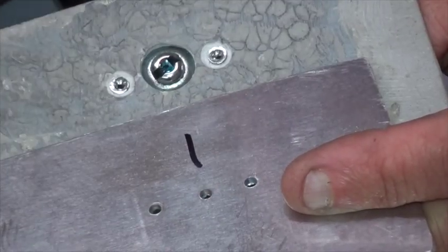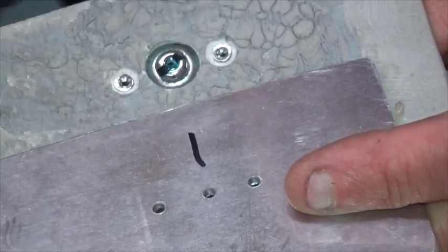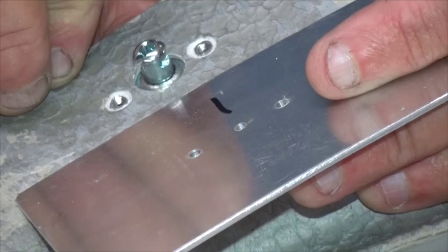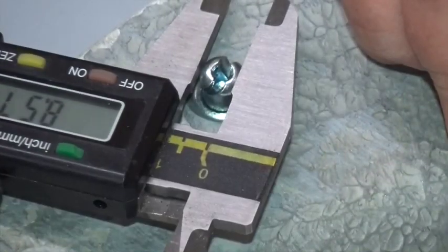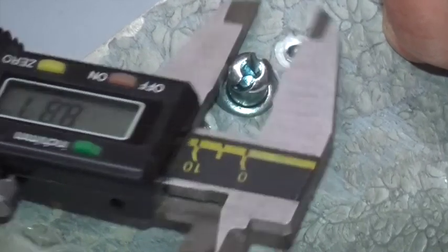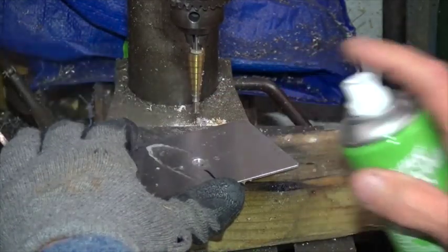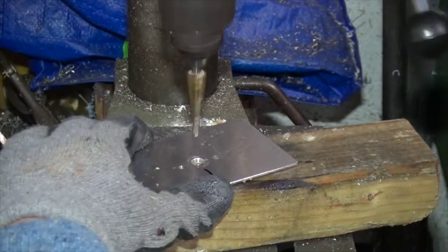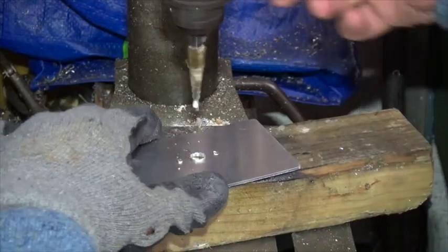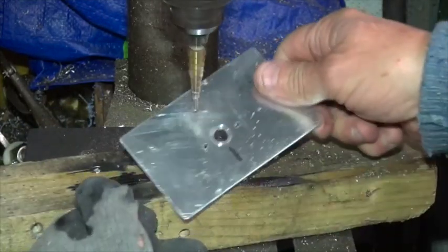Time to fit the spring. We've already got the three holes drilled in the aluminium plate. The centre one we need to open out so it's a clearance hole for the centre part of the quarter turn fastener, which measures 8.6 millimeters, so we can drill a 9 or 10mm hole. I'm using a step drill — a stepped hole cutter — and a little bit of light oil to get a lovely clean cut. Turn it over and remove the burr from the other side.